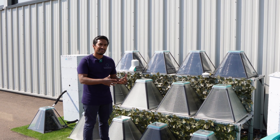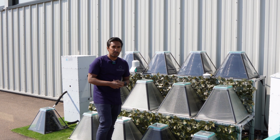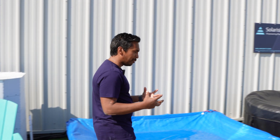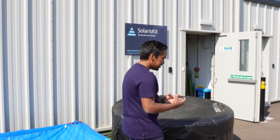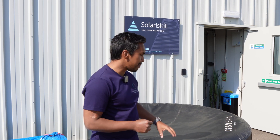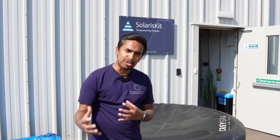The second key component for this system is the pump, which is actually located inside the hot tub. We use a really small 12 volt DC pump which is dropped directly into the hot tub — it's a really simple installation process. You could also tap into the drain fitting of the hot tub to get the flow of water through to the solar collectors, and then just drop a bit of pipe back into the hot tub for the hot water returning from the solar collectors.